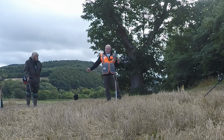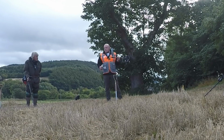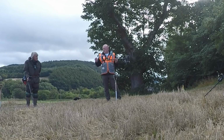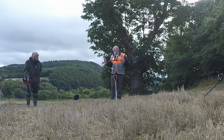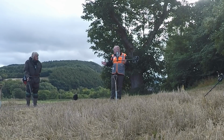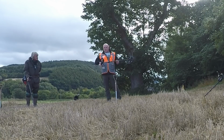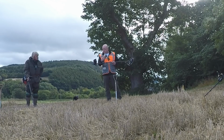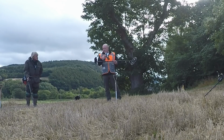I've felt you don't pick up as much ground noise, and it certainly cuts down the amount of falsing you actually get. It makes it slightly more difficult to discern the trickier iron targets in the ground, like your larger iron or your circular iron or your iron with holes in it, because you're not actually hearing it. It'll null it. But I'll come on to threshold. Anyway, that's your volume control there for your non-ferrous and your ferrous signals.